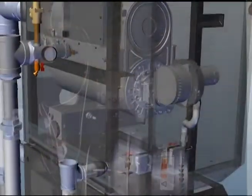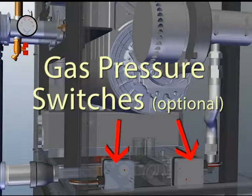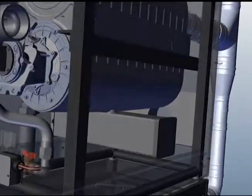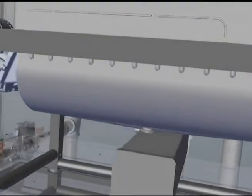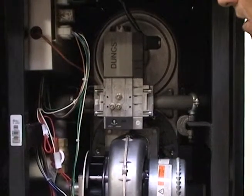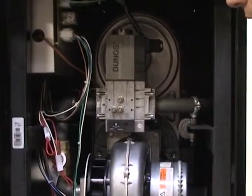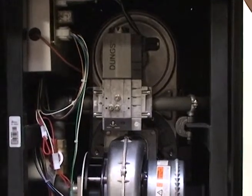It's a very highly efficient system. As a domestic hot water heater, it's probably the highest efficiency you'll see in the market — this thing will condense like crazy and supply a very quick payback in very large commercial domestic hot water jobs. All VWHs have to be connected to large storage tanks — we do not allow direct connect to the system. They'll have pumps that go to and from those large storage tanks, and the system will monitor temperature when there's a requirement and fire the burners accordingly.